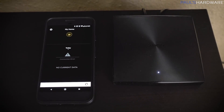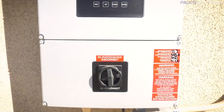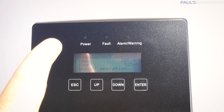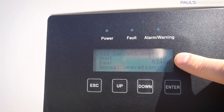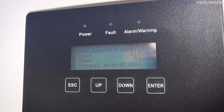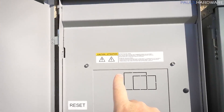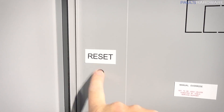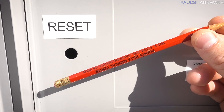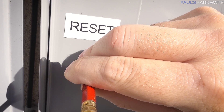Attempt one seems unsuccessful. We still have no connection, so I'm going to have to mess around with this app and see what I can figure out. On the plus side, over at the inverter we can see power is on. You can also see that the panels are working — even though it's morning, we're getting a little over 3,000 watts out of them right now. It's about a 5,000 watt system overall, so that's not bad. It's also showing us how many watt hours we've accumulated for the day. What I'm still not getting is proper connection from the gateway, so I think I'm going to make use of this recessed reset button right there. Make sure to use something non-conductive — I never poke into an electrical box. I usually hold in reset buttons for 5 to 20 seconds.